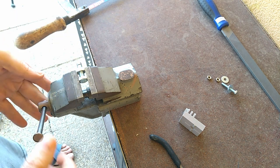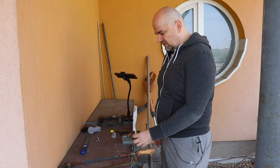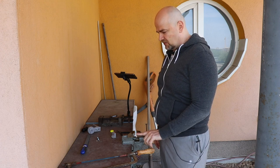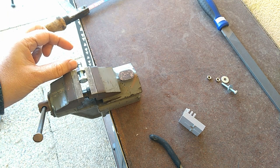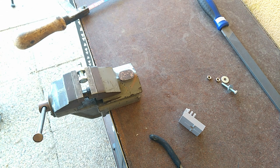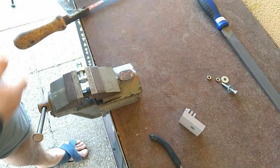A very important rule: never squeeze the thread in the vise because it will deform and damage it and it cannot be useful anymore. I don't squeeze it even on the part I don't need, because for me that's not the vise I will use — I usually use that as a set screw, for example. I have a mark here where I want to cut.